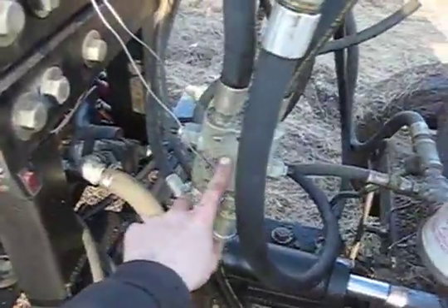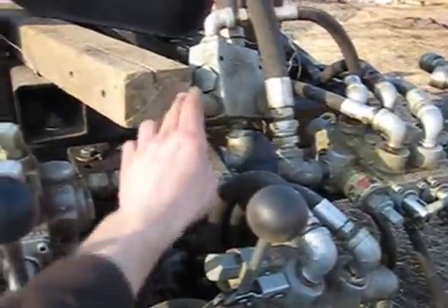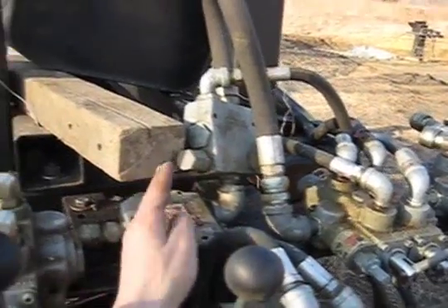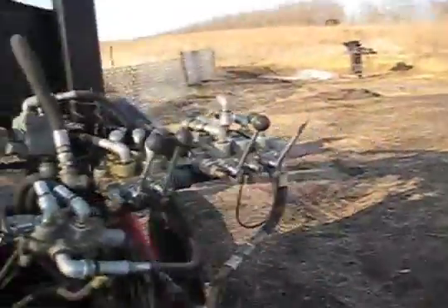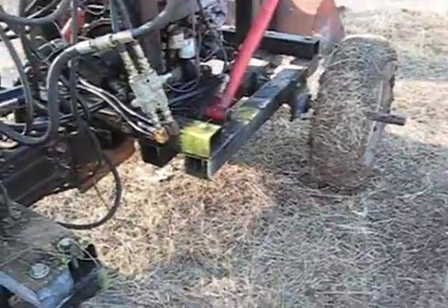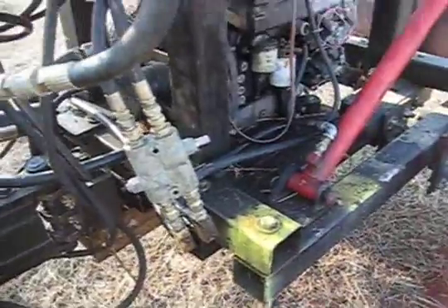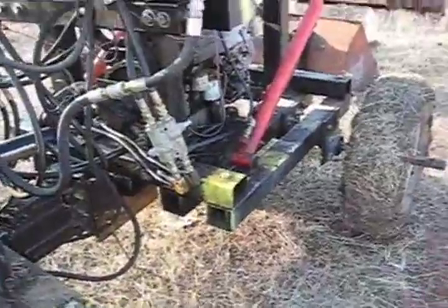Here's a cushion valve for the wheels so that if there's a sudden bump or stop, the fluid bypasses — that's called a cushion valve for the wheels. There's also a flow control valve which allows you to control the amount of fluid power going into the circuit behind it. If you want a lot of power in the hydraulic takeoffs, open it all the way; if you have a small implement that doesn't need much fluid, you can close it down. Furthermore, here is a cushion valve for the actual front end loader — if you have a heavy load and drop it quickly, there's a huge impulse as the fluid stops. This allows a smooth dropping of the front end loader; otherwise it would be very jerky.